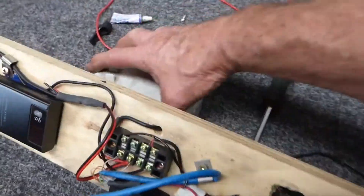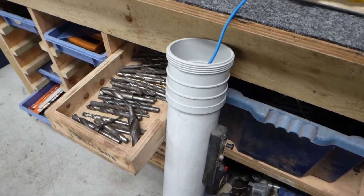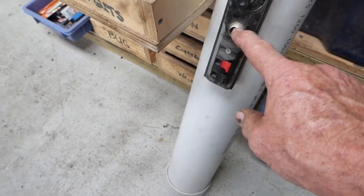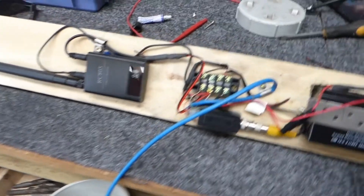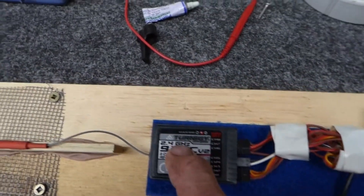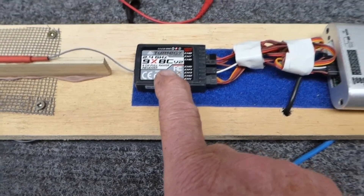I don't know if I've shown you this in depth before — this is my long range setup. It's made so that this thing can be put on top of a roof or can be a hundred yards away from me, and it brings the FPV in by this plug. So the FPV comes in there and I run a Cat 5 plus 2 cable into the TV in the house. And my controller — there's this side of it — I'm using the receiver from my radio.